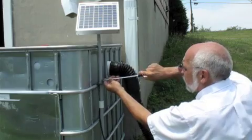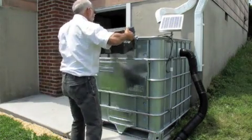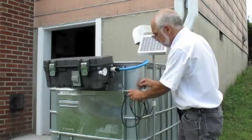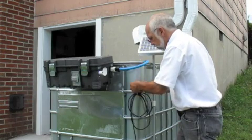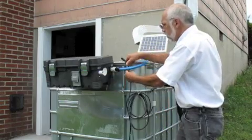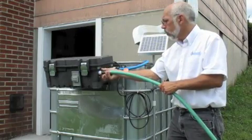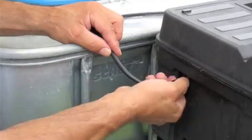Take a moment to attach the solar panel. This box contains the pump controller, the battery, and the pump itself. This hose is the inlet section that will bring water to the pump. Take the extra cord from the solar panel and use a zip tie to secure it in place. Take the lead wire — just being neat about it — put it underneath the hose and throw it over to the other side. One more hose to install on this side of the box. Install the wire from the solar panel with a couple of quick twists.